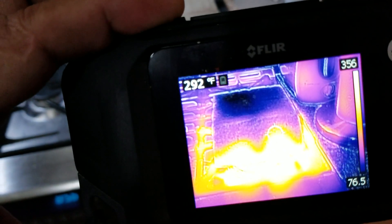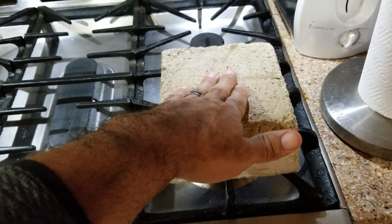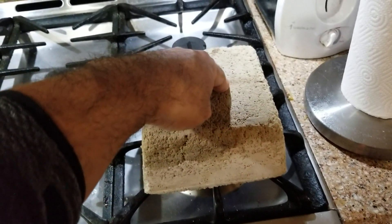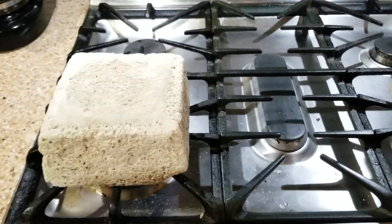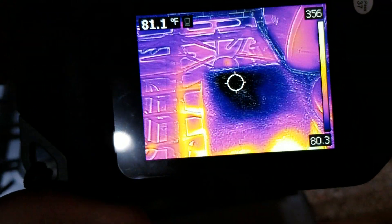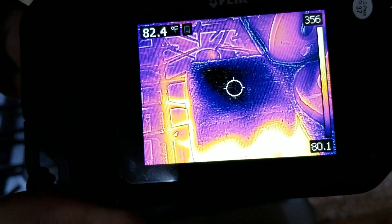For the 30-gallon mix, I made the sample in a 30-gallon garbage container — again seven gallons of cement slurry — and then filled the top of that 30-gallon container with foam as I mixed it. This sample was done with 100 gallons. Here's the thermal imaging again; the very top center of this piece is reading 82 degrees.